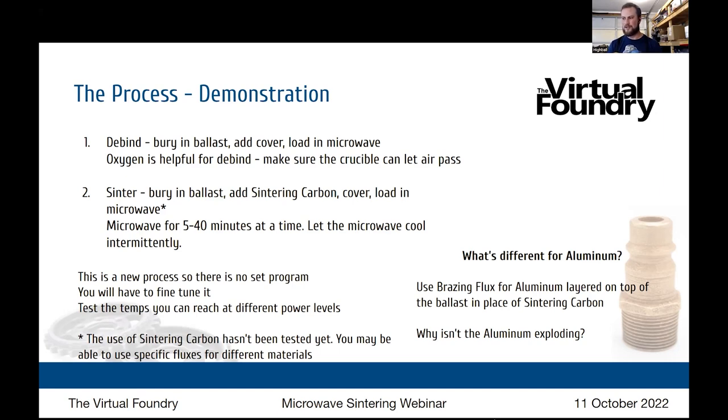I'm not sure it's certainly necessary to do, but again, I haven't seen any noticeable problems by doing that. The biggest problems I've seen are just not quite fully debound parts causing issues. I have seen where I've exceeded the temperature a little bit, where some areas have sagged because they got a little too close to the sun and melted. But other than that, no.